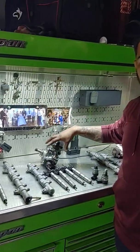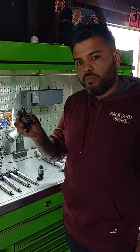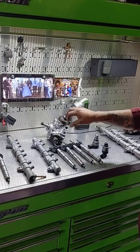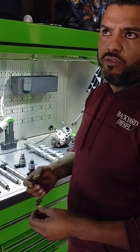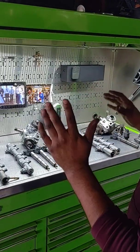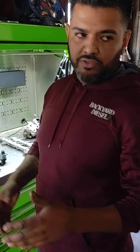I want to take this high-pressure pump off — I'm willing to bet one of those rollers has already been damaged, just judging by the regulator. You can barely see faint shrapnel in there — that's what happened, this thing grenades. That's where the disaster kit comes into play: instead of sending the fuel back into the entire fuel system, it sends it to the filter, which is three to five microns. Do not go with remanufactured. Spend another couple grand to do it right the first time — clean out your system, drop your tank, there's gonna be sparkles in there. New filters, flush the entire system. Take your time.